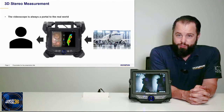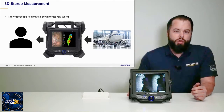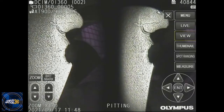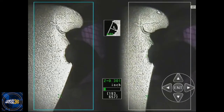That's why 3D modeling is so important, because it allows you to really truly see what you are inspecting. So next we're going to go over to the NX itself. This is a full screen of the NX monitor. I have a preloaded stereo picture — this is a picture of a turbine compressor blade, and we have some pretty major damage on the leading edge of this blade. So we're going to jump into measurement. I'm going to select point to line, because that is the best, most obvious way to measure the amount of missing material.